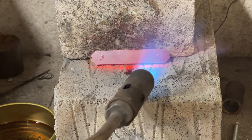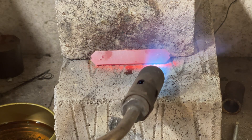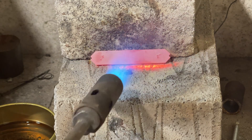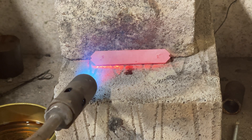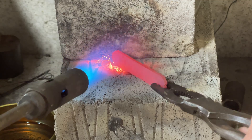This is a roundabout dull red, and we're getting to about cherry red now. I drop the tool into the oil on its edge to stop bowing.